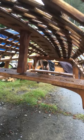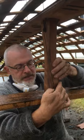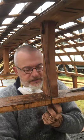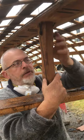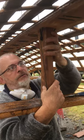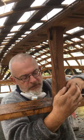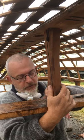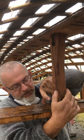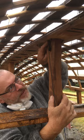We've done a lashing between the post and the keelson. At the top, we will drill and put in a couple of pegs so that — because the important thing is that it has a little bit of motion, it can flex a little bit. The pegs will keep this oriented fore and aft, although we could do almost the same effect by doing a lashing up here as well. But we've lashed, as you can see, a V.